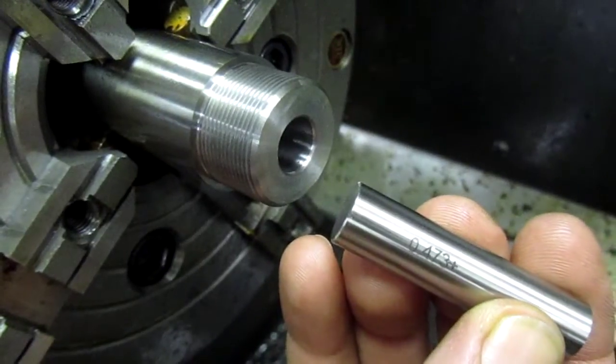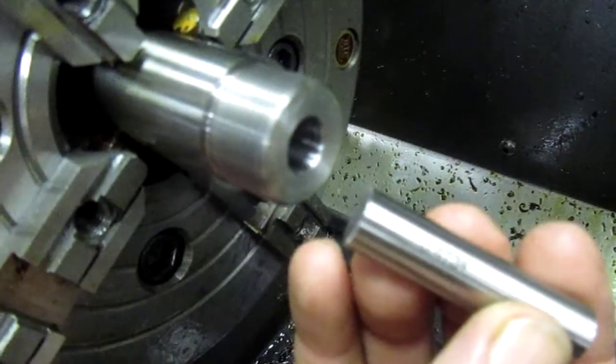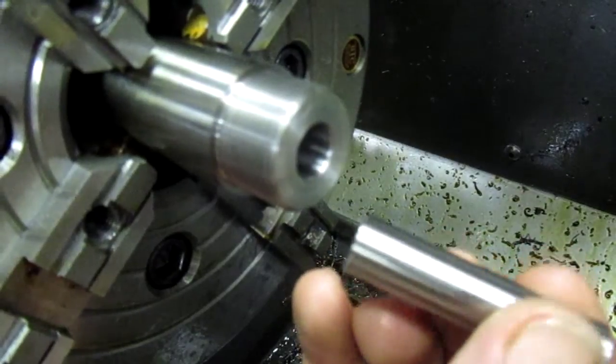The second thing we do is literally a go and no-go test with the diameter of the chamber. An improper setup can cause an oversized chamber where you're blowing your brass out and you've got issues.